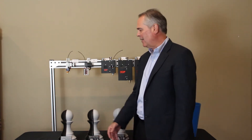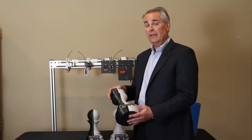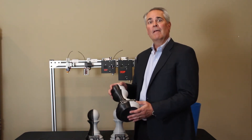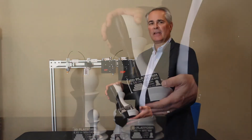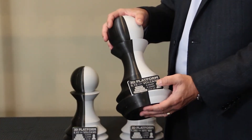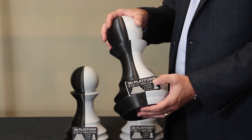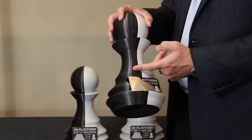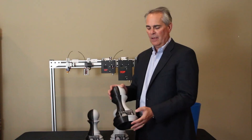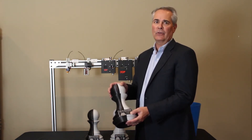Let me give you a little bit of detail and I'm going to talk about three characteristics: fidelity or fine, fast, and lastly finish. Here's a print we did with a very fine nozzle — a 0.25mm nozzle with a 0.06mm layer height. It ended up with wonderful fidelity on the print, but with a negative consequence of a print that took in excess of 100 hours.